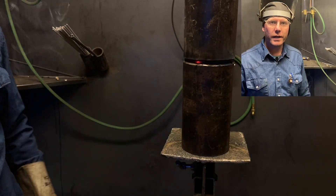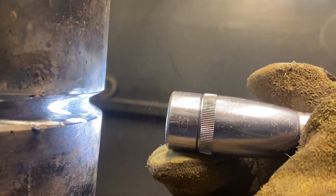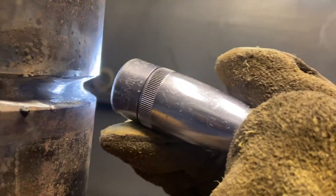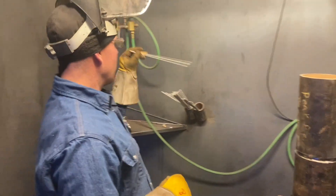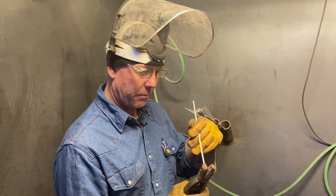There you have it — all we got to do now is grind our wagon tracks out. Like I said in the 2G plate video, for those of you who don't have quite as much experience: grind the weld clean, get rid of those wagon tracks. Notice how it's got a nice U-shape on it from the top of the bevel to the bottom — a real nice smooth transition. That's what 7018 likes. You don't want to cut a big valley in there with sharp corners. We're going to put our hot pass on here next, same as the 2G plate. They call it a hot pass because you're welding on some thin metal after you grind that garbage out of there.